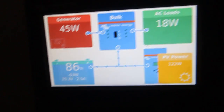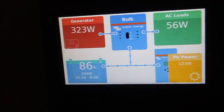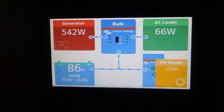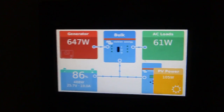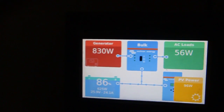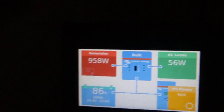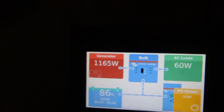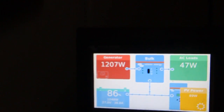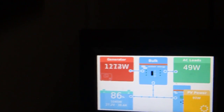Yeah, you see, the power quality just, it will not assist. The power assist is designed for assisting the grid. If you have a boat and you're parking your boat at the shore, you want to charge your boat, you want to, let's say, do a pizza, and at the shore there is a shore limit, 6 amps sometimes, and that's when this guy assists. Strong grid, but not.